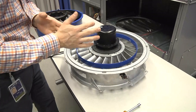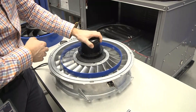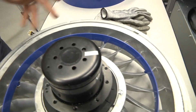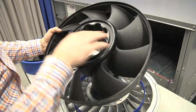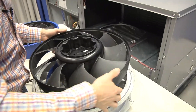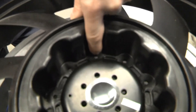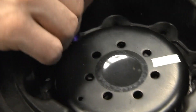The next step is to reinstall the rotor. If you're putting the same rotor on the same motor, line it up with the mark we made for blade one to get the orientation right. If you've replaced a motor or a rotor, there is no rotational directivity that needs to be aligned for a new rotor — we keep it aligned only for balance purposes when reusing an existing rotor. For a new rotor, simply set it on the nose of the motor. It's best to drop an alignment pin, hex wrench, or screwdriver through one of the holes in the fan rotor down into the motor to ensure the fastener holes remain aligned as you press the two together.